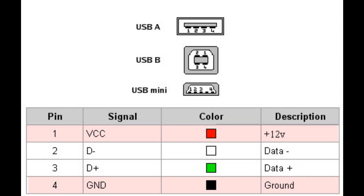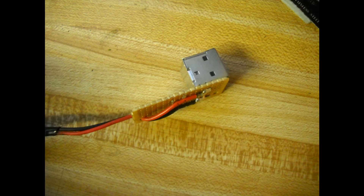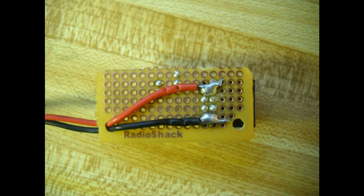On the following diagram you see here, I simply replaced pin 1 with a 12-volt power source, much like the 5-volt stock, and of course left ground as ground. Connecting the PCB USB port to a PCB protoboard picked up from Radio Shack that I had on the shelf, I simply followed up with connecting the power to pin 1 and the ground to pin 4.